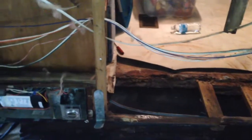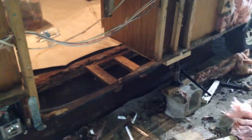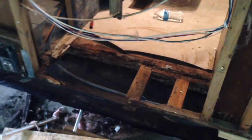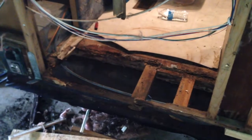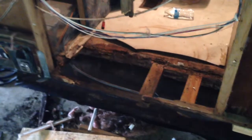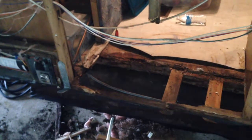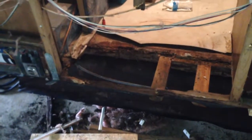All the wood — I'm going to put treated wood. I'll be splitting two-by-fours to do all the framing. When I get done with it, it should be better than when I started. I think the plywood I'll use should be better grade than what they used, and I'll probably treat it somehow. I don't want to use treated plywood because treated plywood kind of sucks — the quality of it. It seems like it's always delaminating. So I'll probably buy regular plywood and maybe fiberglass it with resin, or even Thompson's Water Seal, just to help keep it. And then I'll probably paint it too — just give it a little more of a chance of holding up.